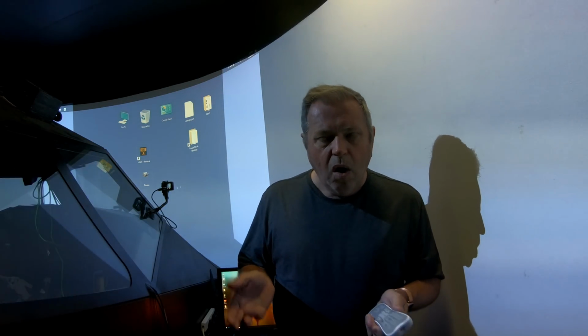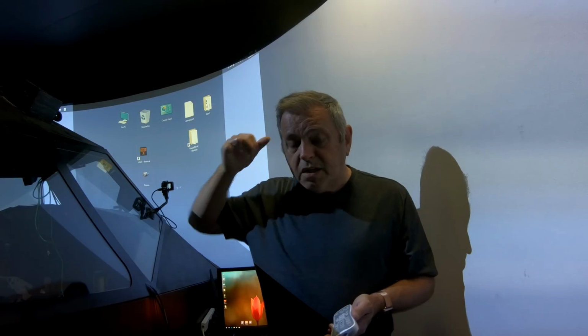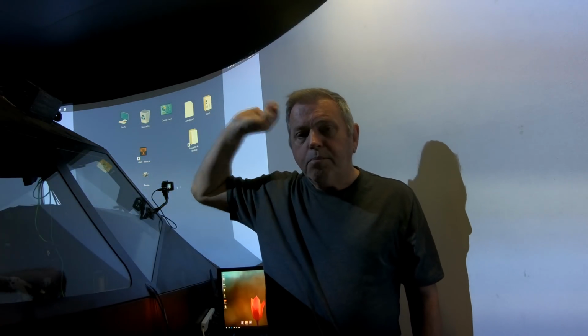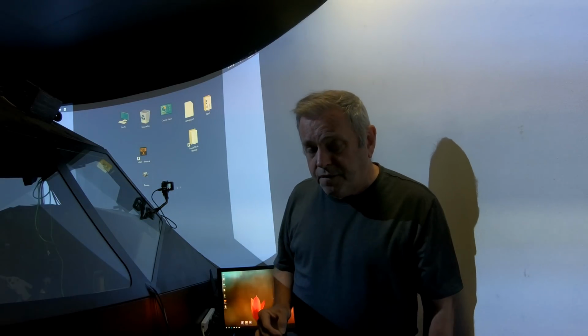So I have eradicated the issue now with that light balance in between, or the calibration imbalance that I had on the 3 projectors. So that's something to bear in mind before we start doing any calibrations. For God's sake, make sure that you calibrate your projectors or bring them all back to a factory reset and start them all over again, and that way at least you've got a good starting point. So that's what I did.